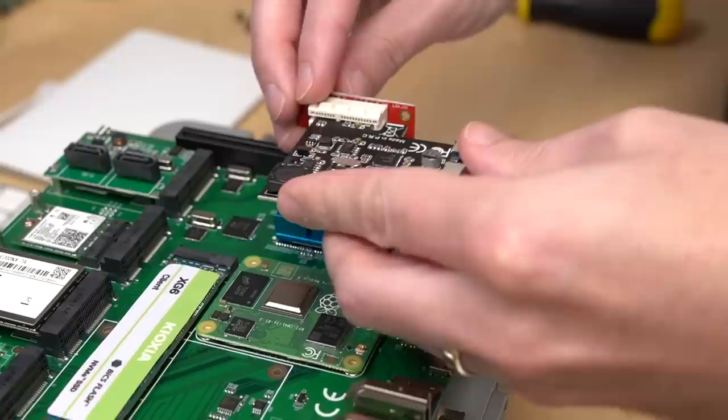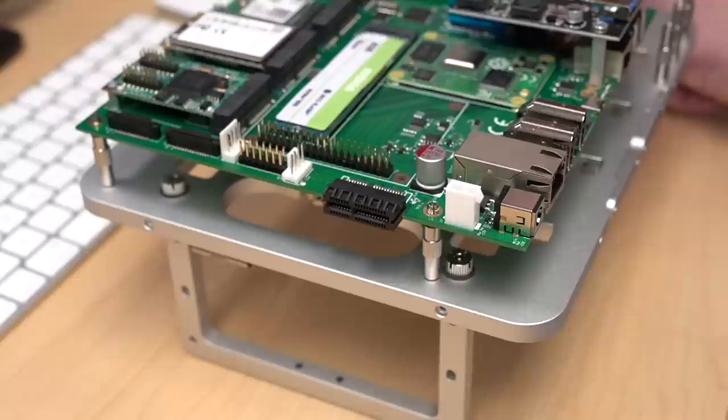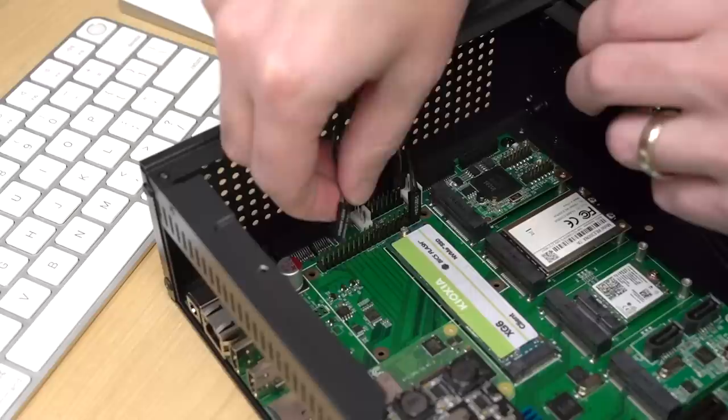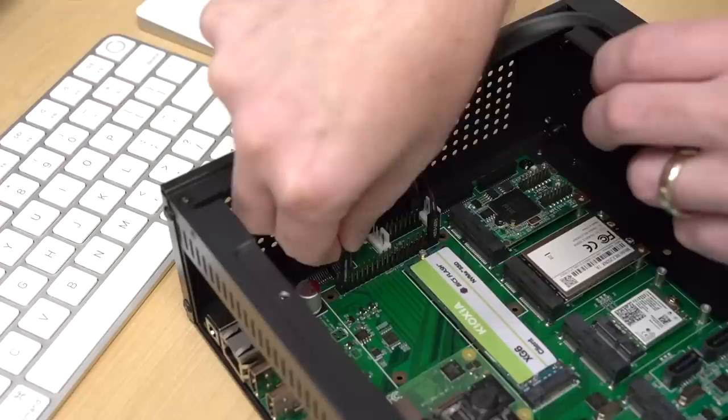For the big x16 slot, I'm a little disappointed with the built-in USB 2, so I might as well put in a USB 3 card. The Seaberry has mounting points so I can mount it horizontally, with the ports all inside the I/O opening on the back of my case. I'll leave the side slot empty for future expansion, and then install the Seaberry in my case and wire up the front panel power button and LEDs to the board.